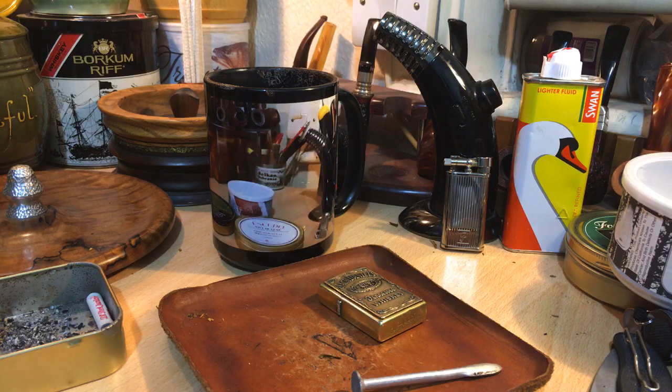It could be, you might have a beautiful straight grain or bird's eye when you look at it first, and then by the time you get down to your shape, it could be much less and it won't be as nice. But I have to say that if you're working on plateau blocks especially, you've got a reasonable chance of getting a reasonable grain. You can never be assured of getting a high grade type of straight grain or anything like that. And to be honest, even if you had a high grade potential in a pipe, if you do it the way I do it, the chances of getting it to be a high grade pipe is very low,